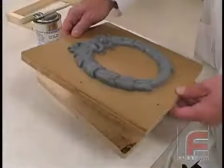When constructing rigid molds, proper sealing and releasing is very important. We have already applied two coats of wood and plaster sealer, and here we are applying our second coat of wax release. We were careful to apply this to the detailed areas first and then immediately buff those areas to avoid buildup before moving on to the less detailed areas. Next we apply two coats of PVA and then a final coat of wax release.